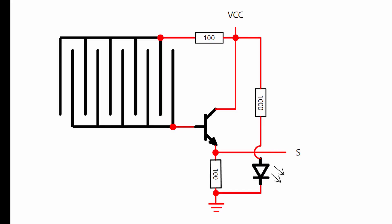As you can see from the schematic diagram, the operation of this module is simple. If the board has water or other fluid covering the exposed traces, the resistance is decreased which increases the current flow driving the base of the transistor and thus providing the maximum output analog value on pin S. The resistors are there to protect against shorts. The resistor and the LED parallel to the transistor turns on if the voltage is just applied.